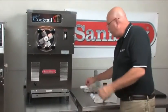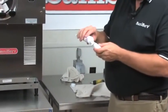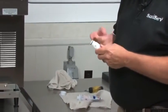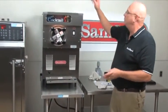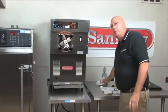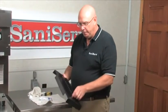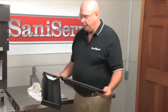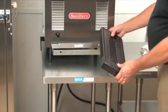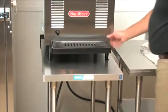Next, I'm going to take the restrictor tube and its O-ring, slip it on, add a little bit of lubricant, and work it into its hole. Drop this in the mix pan to be sanitized but not inserted into the inlet tube yet. The drip tray has been washed and allowed to air dry — it just snaps into place. These two notches go to the back and go around the screws that hold it in place. It goes behind the whole thing, slides down, and it's secure. Ready to sanitize.